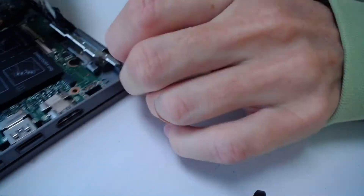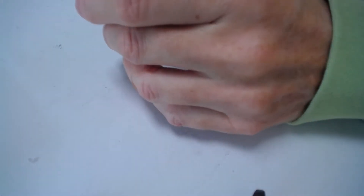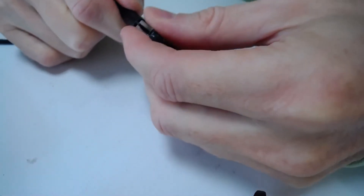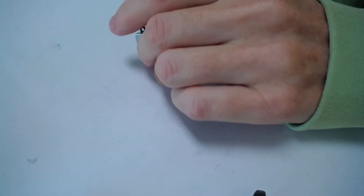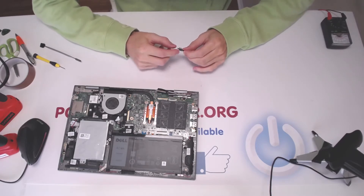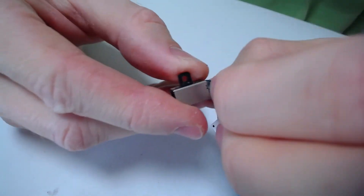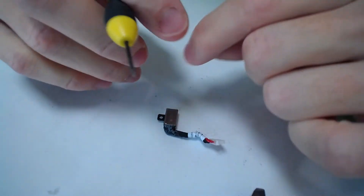Let's see if we can get this thing out. Alright, so we got the jack out. Seems like something is stuck inside probably — let's see why we can't plug in this guy into here. Yeah, we can't. I mean it doesn't fit. What I want to do is remove the wires from the back of the jack by soldering them. But before I do that, I need to remove all of that hot glue in the back of the jack. I'm just going to use this screwdriver to pry it out.